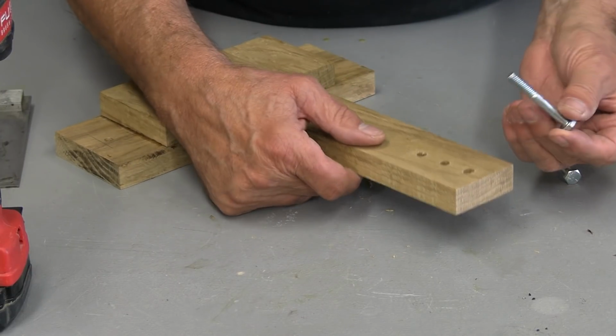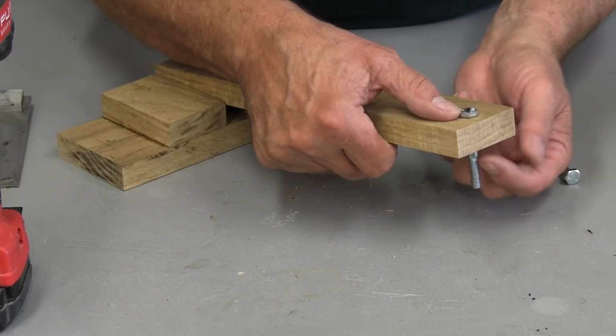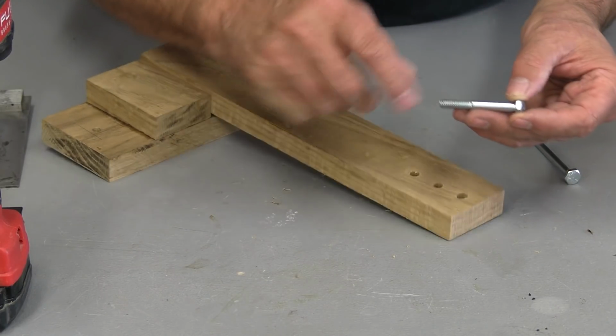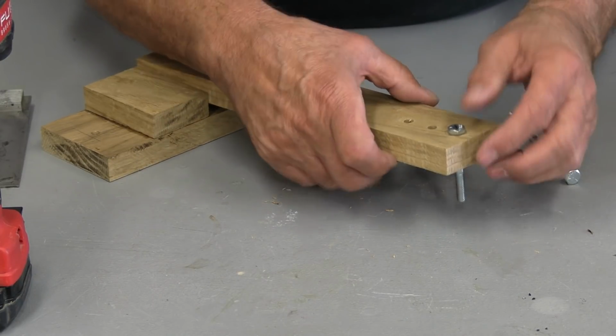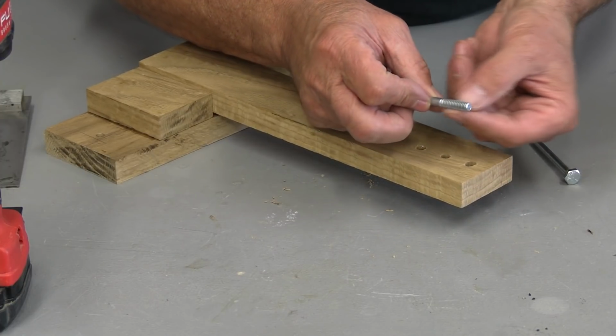And what I've done in the past, I've typically just used a bolt and I put it through there and threaded up from the bottom. But what I found with that is after you've cut a few bowls, because you're spinning this on a template underneath, it starts to wear. The thread always starts to wear on wood. This is very hard on wood.